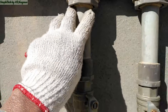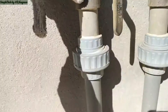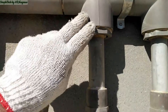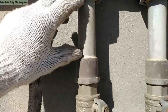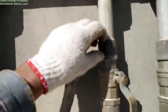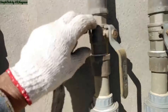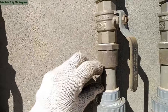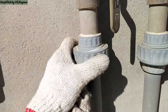Next, this one is the downfeed going to the family room toilet and bath. The two-inch T, the two by one inch reducer, the short pipe, the male adapter, the one-inch gate valve, the male adapter, one-inch short pipe, and then the union coupling.